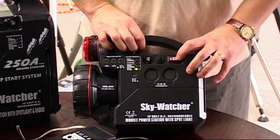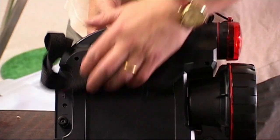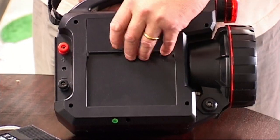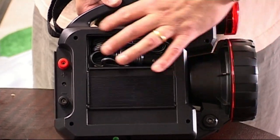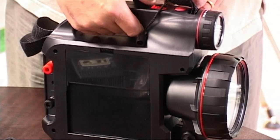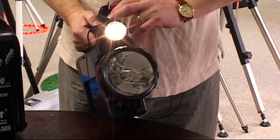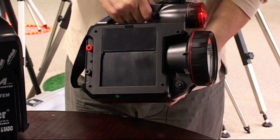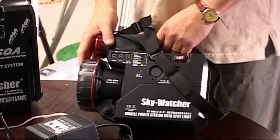It's also got an overall on/off switch so you can make sure everything is off by throwing that switch at the top. On the rear of the device we've got a couple of banana socket takeoff points — no specific astronomical use, but it might come in handy. We've also got the charging system running from a cigar lighter socket, hidden away in a little pocket at the back. The red lens actually comes off the top and gives you a second, less intense white light option. At 7 ampere hours, this will power a 1-amp telescope for 7 hours solid.